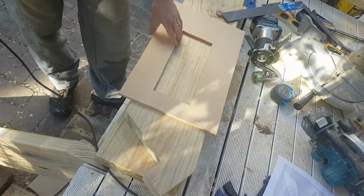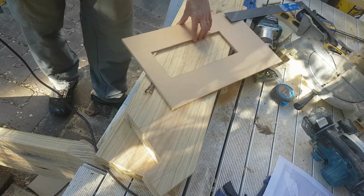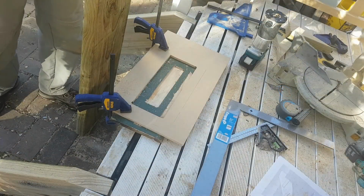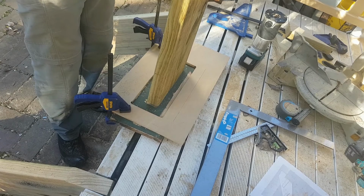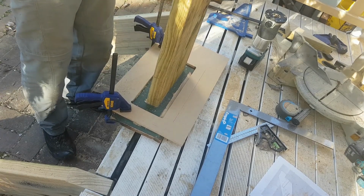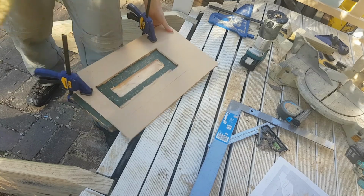Alright, she's pretty rough, but these only have to be fairly rough mortises. Let's see if we can do this. You know what though? I think I'm going to get a scrap piece and do a test first. Right, I put a straight edge along there and did some cleaning with the router. That's my test little mortise. And that's a step going into the test mortise. Nice and tight. Don't break the jig after you just made it, James.